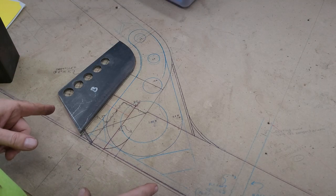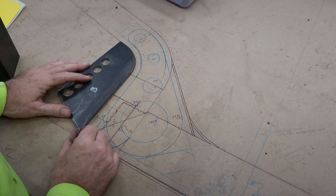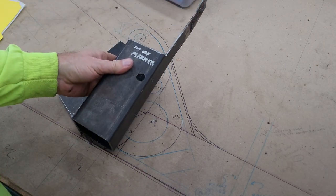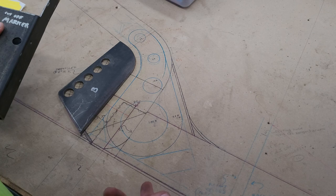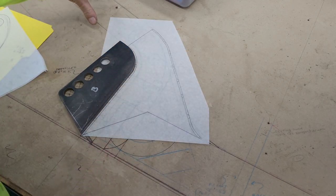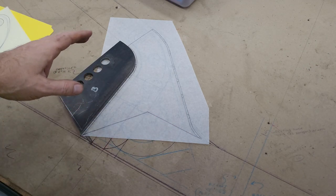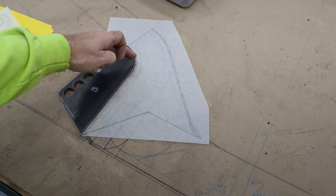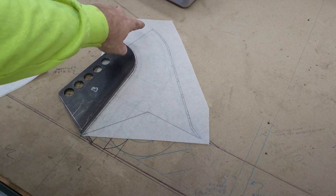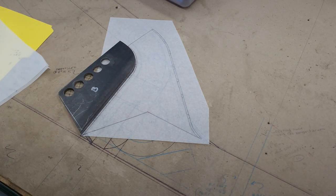So as you can see we've been doing a little more work to our blueprint. What I've decided to do is redo the way I'm approaching this. My original intent was to just bring this down and weld it — I wasn't sure how I was going to intersect all this with the bracket on the back. The original design just came straight down and this just teed into it, and that's not a super strong junction. So instead, I'm going to make this piece here out of a sheet of eighth-inch steel, make two of them, and then just fill in the two inches on the top and the bottom.